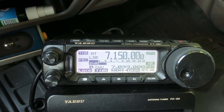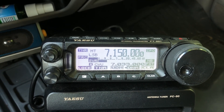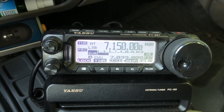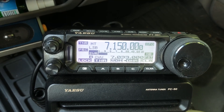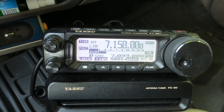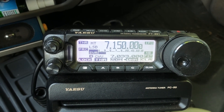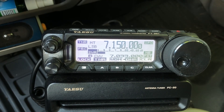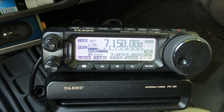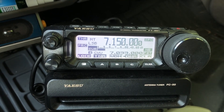That's sensitivity, of course. You don't need more sensitivity when you're mobile, because you're just going to pull in more noise — and that's not very advisable, especially on the lower frequencies. Maybe when I'm up on 17 meters — I like to operate 17 mobile, and 10 meters mobile is great — I might opt to engage the RF amplifier, which means disabling IPO. But on these lower frequencies, I definitely run IPO and sometimes even attenuation, just to knock that noise floor down.